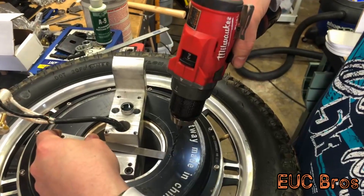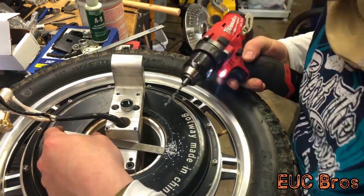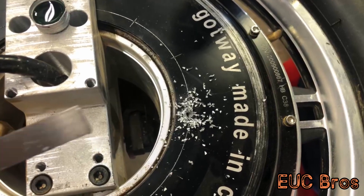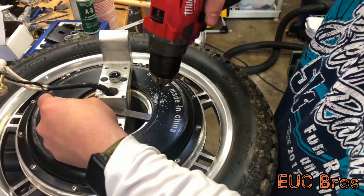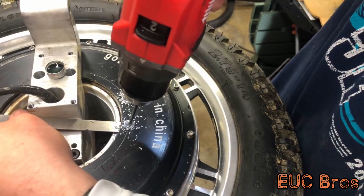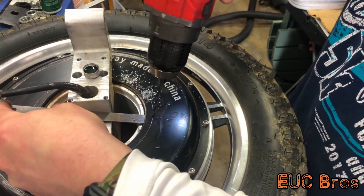High speed as your drill will do. Find your punch mark, and you can see when I break through I'm just hitting the shim behind it, so it doesn't go through into the bearing — that's super important. Get a little more cutting oil, and repeat. Then do the other side, vacuum everything off, clean as well as you can.